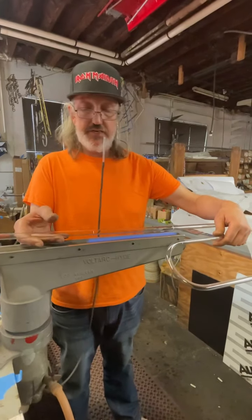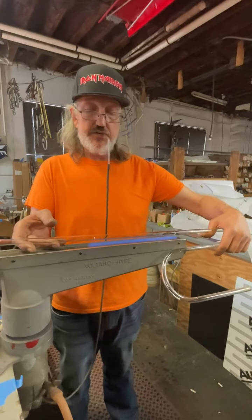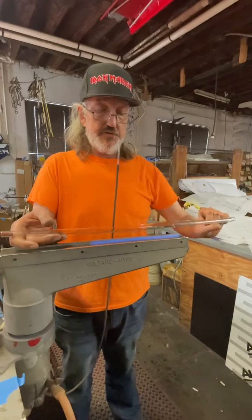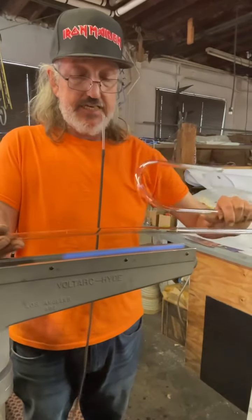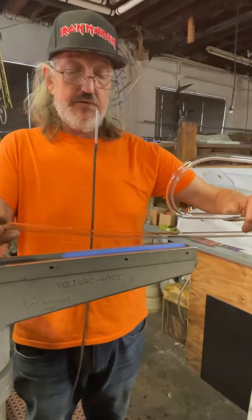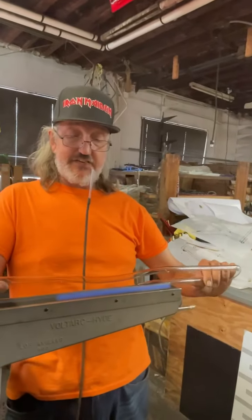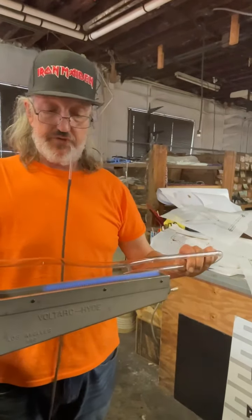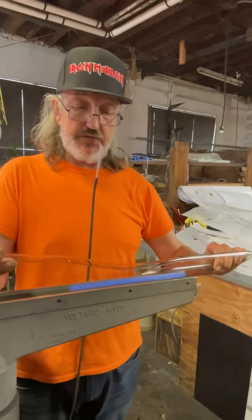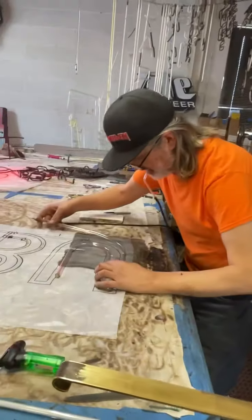Making a letter U for the museum sign I'm working on — it's an outline letter. This is the last bend of this portion of glass. The sign's right over there. See how flexible this glass gets when it's ready to bend. The key is to not let it get away from you. You want to get it nice and hot so when you go to lay your bend — and with these U's you've got to kind of follow the previous U you made, then lay it on your pattern and bring it around.